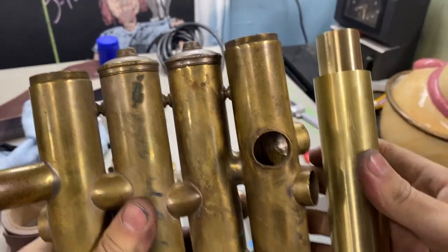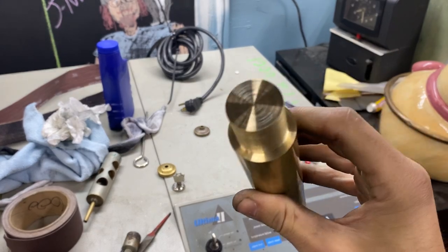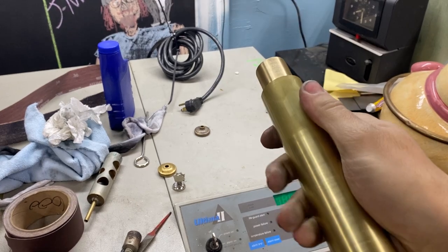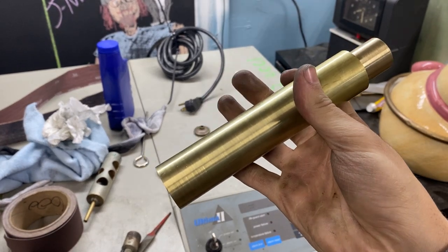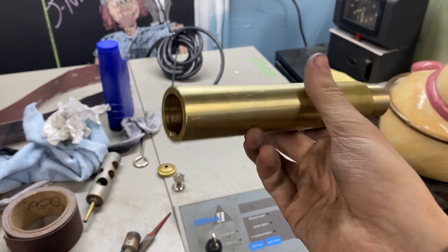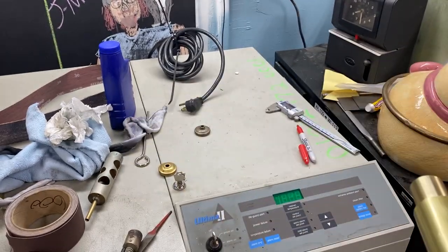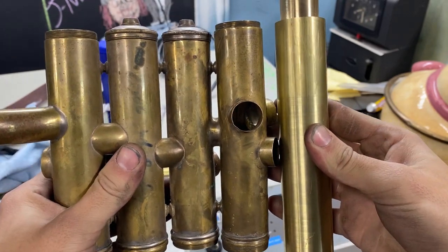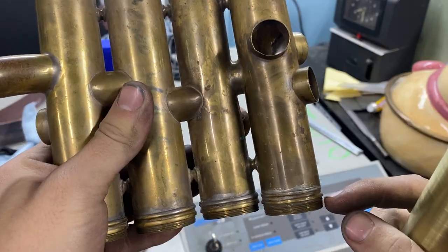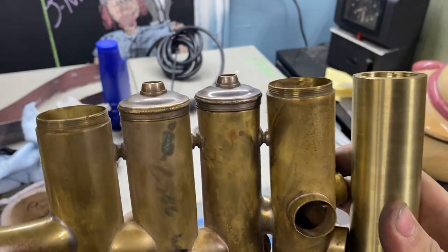What we're going to do — our arbor is going to be the bottom. I turned an arbor on here so I get to hold it in a 5C collet. I don't have a rotary table with a chuck, so all I have is my collet indexer, which hopefully will get us through this. We're going to kind of rig it up, get a bunch of clamps on here to hold it still and some jacks just to make extra sure. And I have a tailstock, of course. So we'll make a little plug that goes in here and the tailstock will reference against that plug. We're going to call the arbor the top. This is an insert that gets soldered down, so that's super easy.